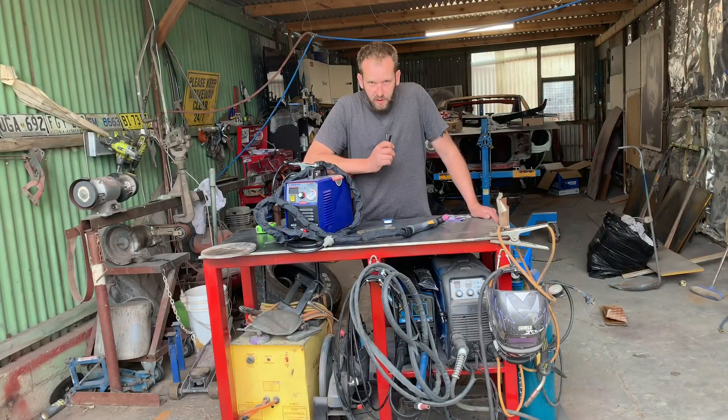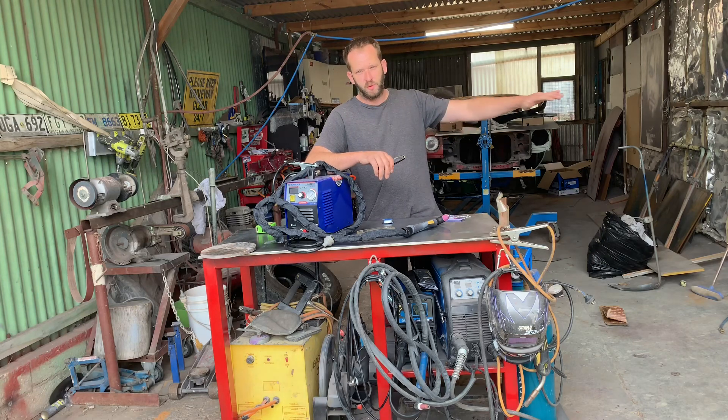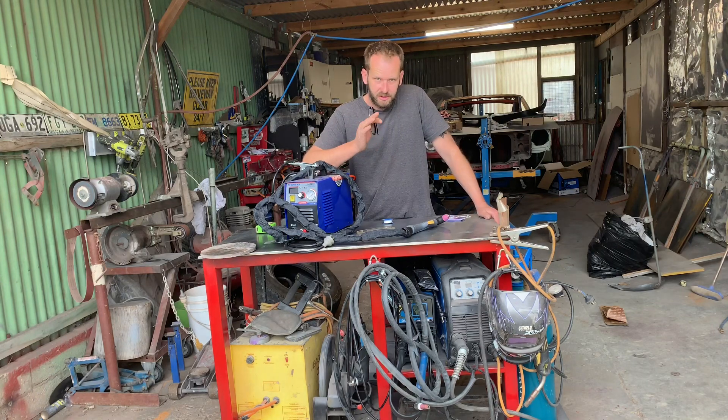I've done a bit of research and I think I know where I went wrong with my cut. I think I was pushing it outside of its duty cycle — it's got a 35% duty cycle at full amps. That means you have to stop every 3.5 minutes of work time and let the machine rest for 6.5 minutes before you start again. That explains why my cut was getting worse towards the end — it was a pretty long cut on heavy duty steel. The second cut I made, I didn't really clean it up that well, so that would have been a factor too.